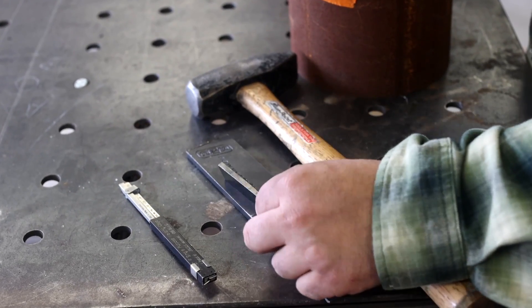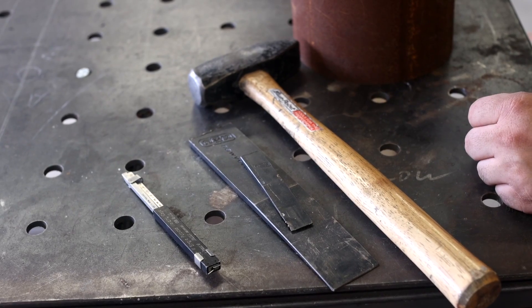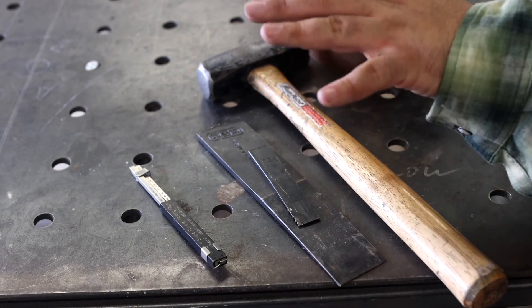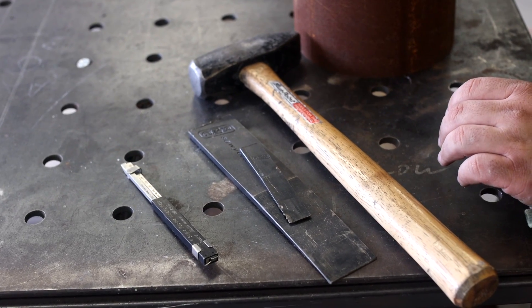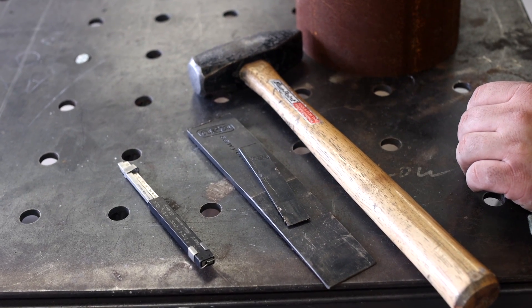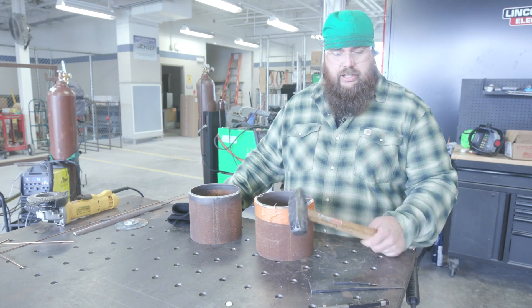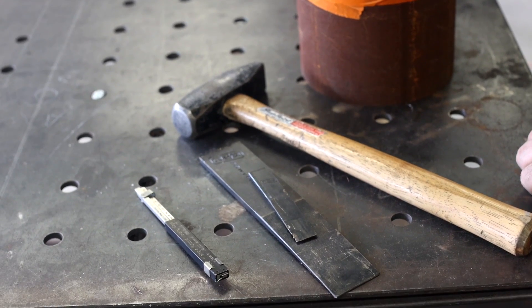Machine wedges — these are hardened tool steel wedges. These will move some pipe around. If I'm worried about a gap closing up, I'll shove one of these in there. This is another tool to make sure I can move this gap around, because as I'm tacking it's going to shrink towards my direction of travel. So I'm going to have to open it up even after my first tack. And of course, you've got to have something — a persuader, if you will — to move metal around.